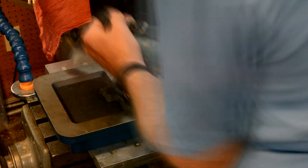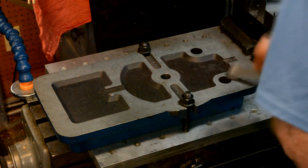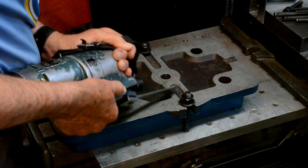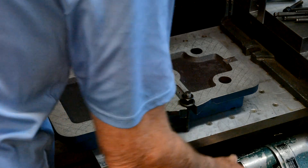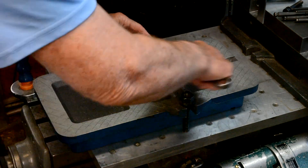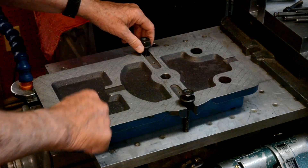I couldn't get the beginnings of a lot of these cuts because the edge will chip your cutter. So what I'm going to do is flip the vise around 180 degrees and then finish this edge along here.